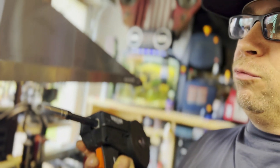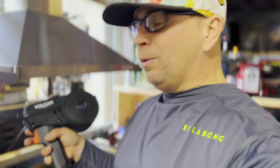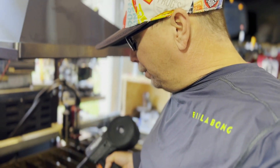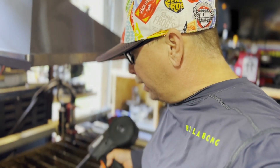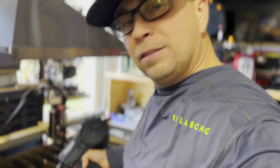Eventually, like a plasma cutter, you can burn through metal — especially sheet metal. What you do first is tack where you need to go: just hit your little button, make sure there's about a half inch of wire sticking out. The directions tell you how to feed this and load the spool. What's recommended is holding this gun with two hands and practicing at an angle. There's actually an acronym for the distance you want to keep between the welding wire and the surface.